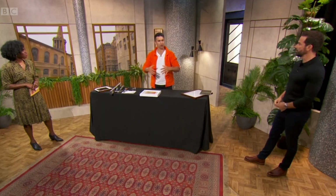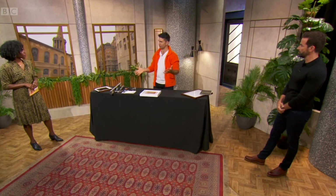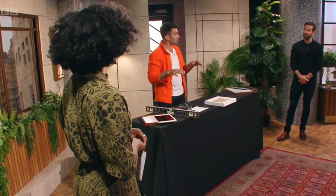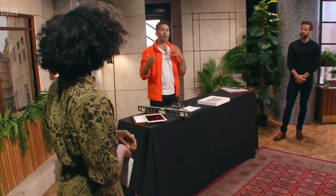So the big rule that all the galleries use is the 5-foot rule. They've worked out the average eye level of the population is 5 feet. So if you hang all your artwork in your lounge, for example, at 5 feet, all around the room, you walk into the room, you see the horizon line, and you get to enjoy the artwork. If you're in a dining room, which is a seated room, you're a little bit lower, so drop it a couple of inches. So already we're breaking the rules, but we've made an informed decision as to why we're doing it.